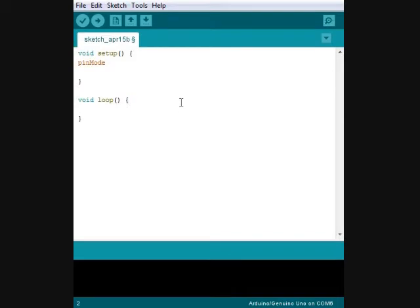Here we put pin mode 2 to input because the button is sending information in, and pin mode 3 to output because it's sending information out. Now down here, we're having to put in INT button equals digital read 2. This means that from now on, where you see the word button, it's the information that is being read from pin 2. So when you push the button, either it's on or it's off. And that'll be stored in the word button in this script.